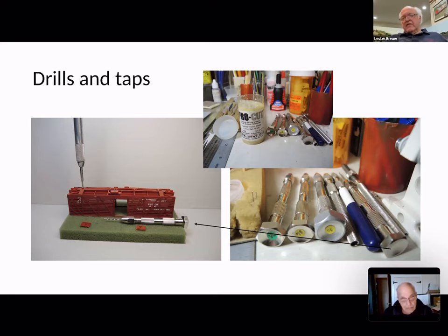Now we've got the underframe attached. Usually the next step is to attach the couplers and trucks. I like to drill and tap 2-56 for the trucks and couplers. I like to have different sizes of pin vise available. When you're tapping, sometimes the tap really doesn't want to go in easily — especially in metal or even resin. I use an old product called Pro Cut, basically beeswax. You can buy a chunk of beeswax at the hardware store and it accomplishes the same task.